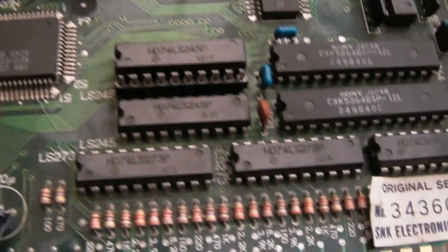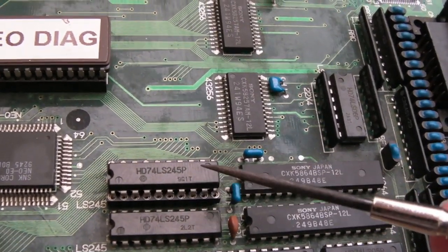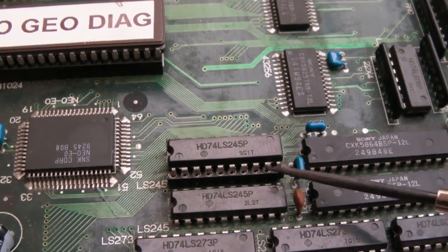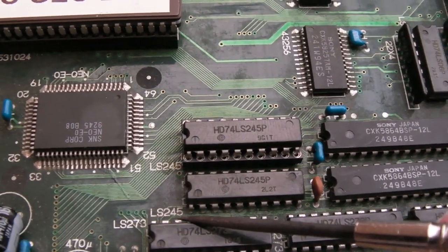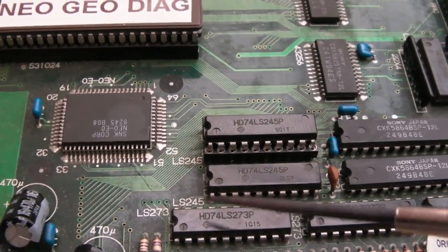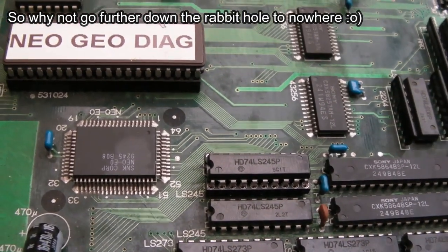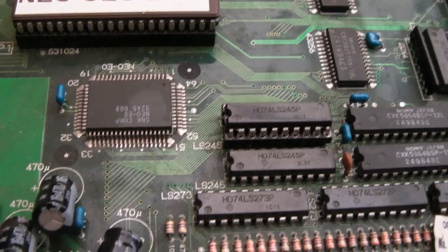So that didn't solve my problem. The bit is still there. Now, with the chip off, everything looks okay. But just following the connections, that second pin there, the A8 pin or whatever it is we're looking at, goes to the third pin along here on the 273. And the one below it, its second to end pin there, goes to the third pin below. So I'm thinking that 273, but I don't think this is causing the actual fault we're seeing. It might do, if we're lucky. So I'll remove that 273 and we'll just see what happens then.